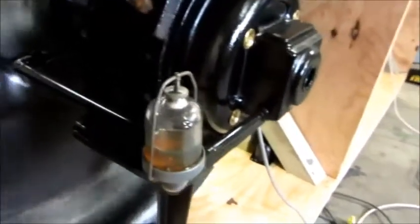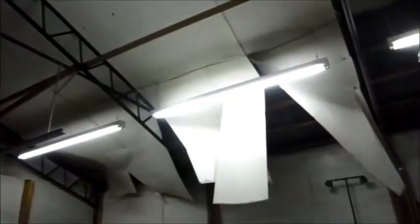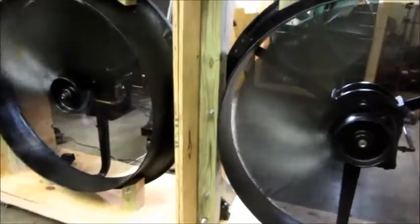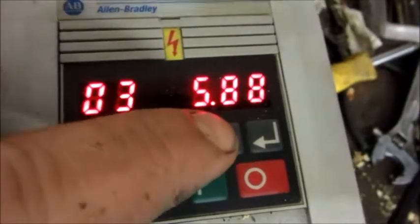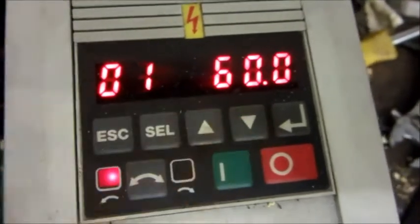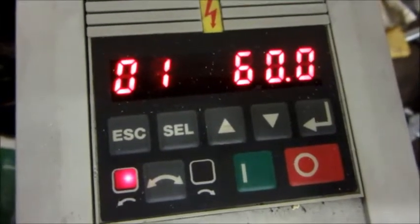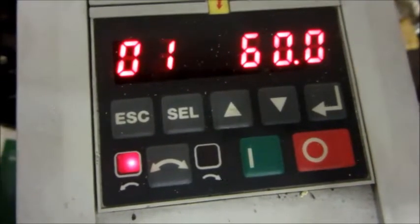You can see the difference — there's a single oiler on this one. There's a lot of air movement in this building with those two going. That's the motor current running with the two motors together. Motor voltage 204 volts. Right at 3 amps apiece, and they're rated for 3.6, so that's good — the motors are definitely not under any kind of stress.